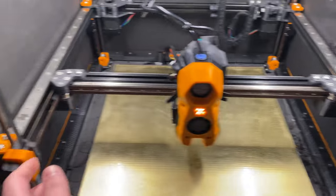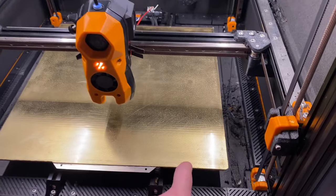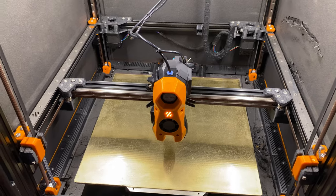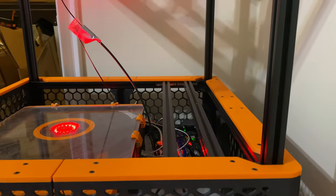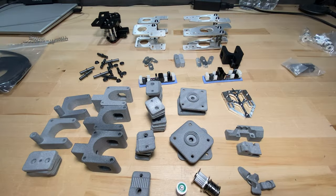One motor will sit on each of the four corners — two per axis (A and B). One downside is I'll lose some print area in the corners, but since this is a 350mm bed it's already huge, so losing a bit isn't the end of the world. To do that I obviously have to disassemble the printer and remove the gantry. The Enraged Rabbit Project carrot feeder will be reprinted with the newer v2 parts and the filament holders will also be reprinted — those will be covered in the next video.